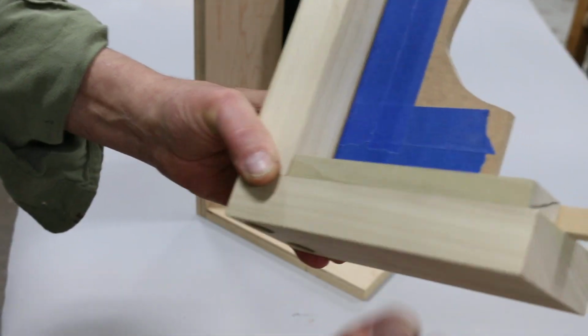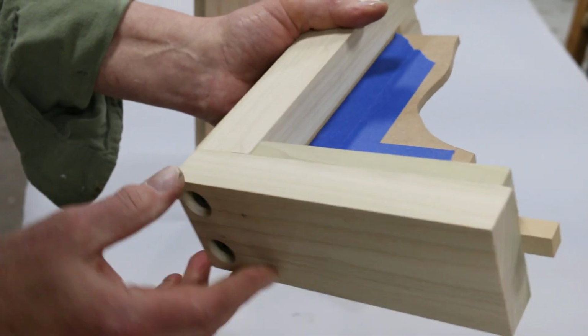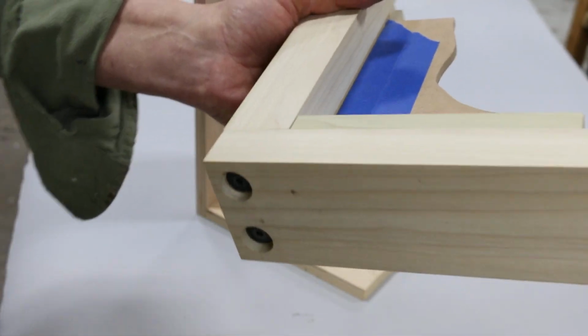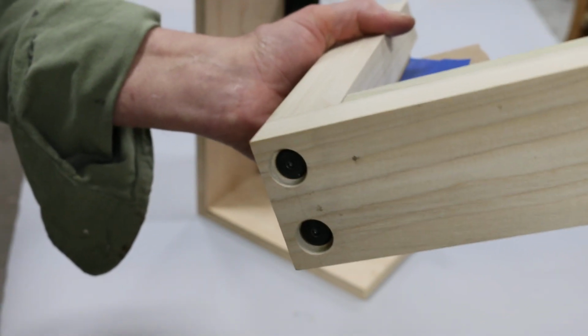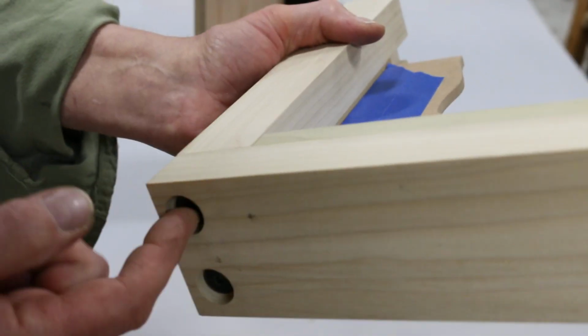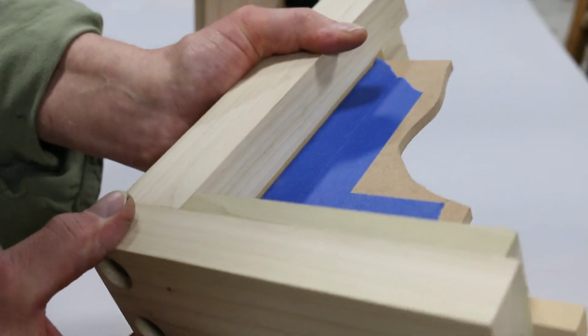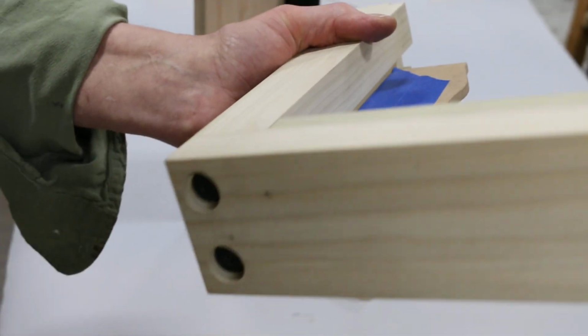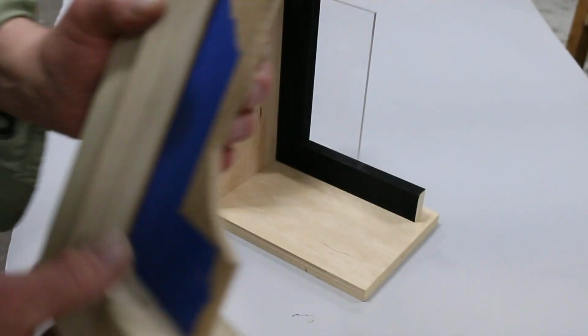And because it's a steel machine thread, it's very secure, it's very rigid, and it also allows people to run these screws in and out as many times as needed. If you're running a wood thread in, it can get sloppy and worn over time. These steel machine threads can be obviously run in hundreds of times.